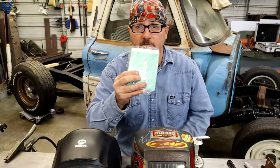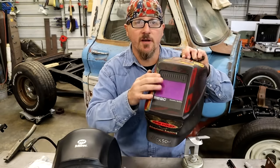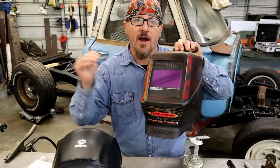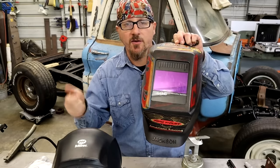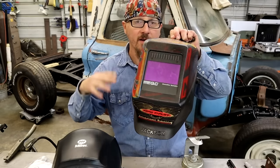All right, guys, down to the last tip. Tip number one, I think, is one of the most important things you can do when you can't see welding. Besides body position, I'm going to say that's number two probably, but is your cover lens on the front of your shield. People, and I'm guilty too, don't change this enough, especially if you do a lot of MIG welding. You get spatter back, stick welding especially. Puts little divots all in it, and it'll refract light. It runs everywhere. You look through this thing when it's nice before you strike your arc, and it looks good and clear to you. You strike that arc and then you just see rays of light, just like the laser beam show, going everywhere, and it just messes your sight up.